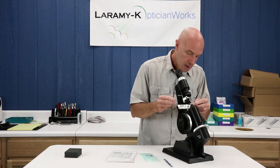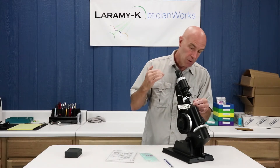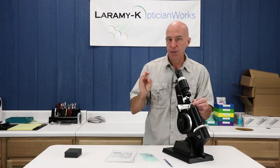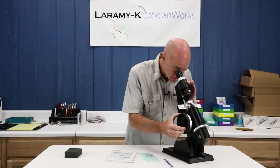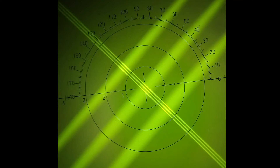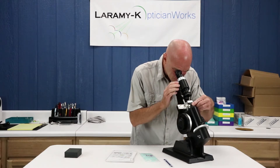When you're putting the lens in up against the lens stop, make sure the top of the line is below the opening of the lens stop. If you catch the line anywhere above that, you're going to get a little bit of distortion that you don't want. Double check that, then lower your lens holder. When you look inside you should have good crisp sphere lines and they should be closed. Use your Spectacle Table to get those lined up.